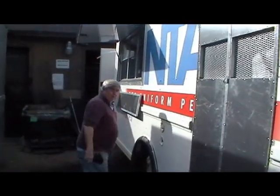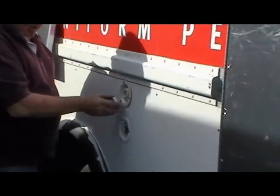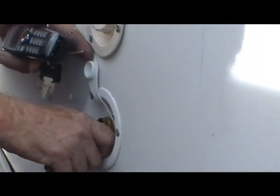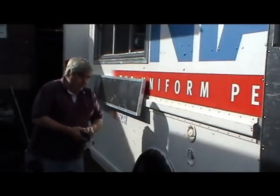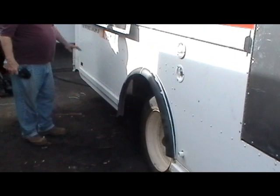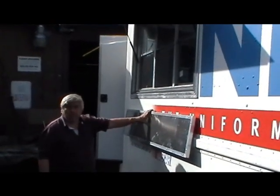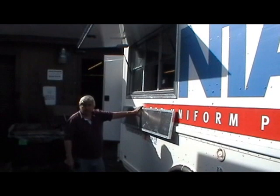The next thing we do to all our sink systems on the inside: this is your fill port for filling your water holding tank, and this is your hookup for a hose if you have water available — you don't have to use your pump, just hook a hose right in and charge your system. Your holding tank is underneath with a dump valve behind the wheel for waste water from your sinks. This one has a 20-gallon fresh and a 30-gallon waste — enough for building code if you're not doing a lot of dishwashing, more cooking and serving.